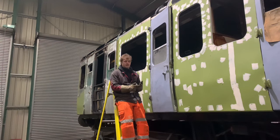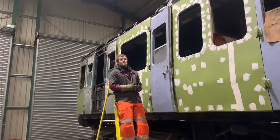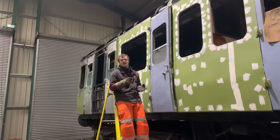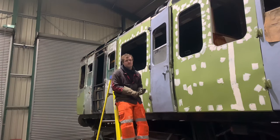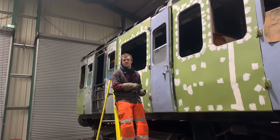degreaser for the galvanized roof, because it was galvanized. I say was because it still is in places, but obviously the weather hasn't been kind to her when paint's come off, and in some places there is no galvanizing left. So you prep it with that, wash that off, and then two coats of etch primer, which we put on, and then first coat of black, and it still needs a second coat of black,